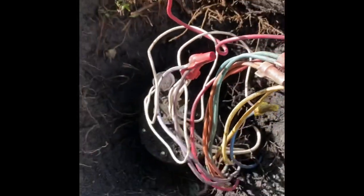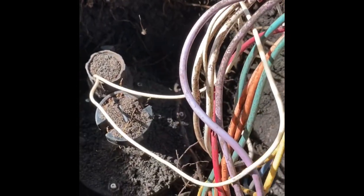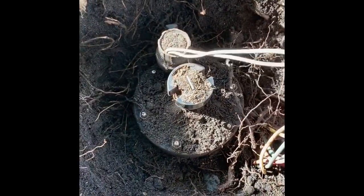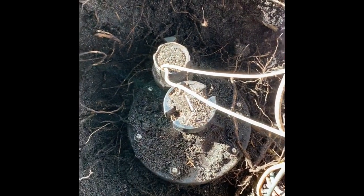What's up everybody? So here's our situation. We have a valve in here, and we got about six more zones going down this way, but this valve is slipping. What that means is every time it's on, water's coming through, but it's not shutting off. So every time I switch zones, the other zone comes on, but this one still stays on.